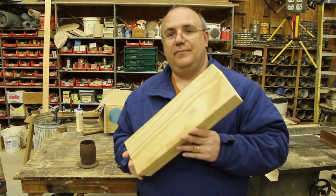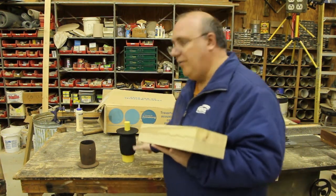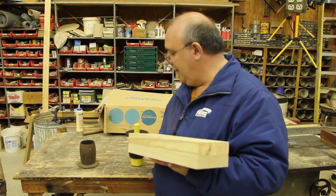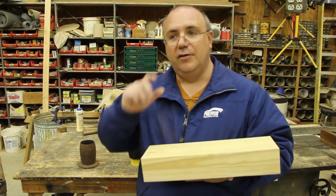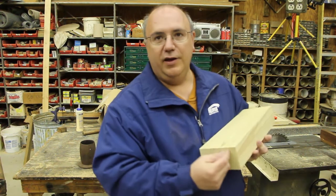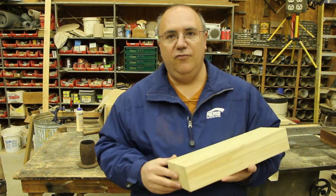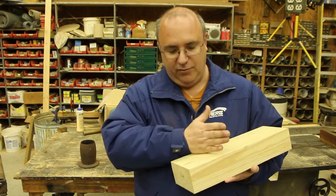This is the piece of wood we're going to use — I just glued this up from some lumber. The first step is to make the large end of the core box, which is three inches in diameter. We need a half of a hole; the core box will only make half of the core itself. You'll make two of them and glue them together to make the full round piece. We'll start by making a half-hole cut into the end, going three and seven eighths inches deep, cutting the piece off about four and a half inches. Using a Forstner bit, we'll come into the end and make that hole that will become part of our core.